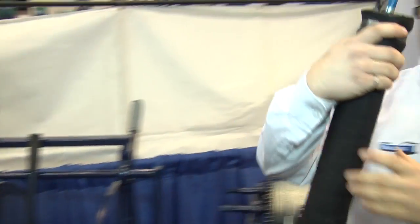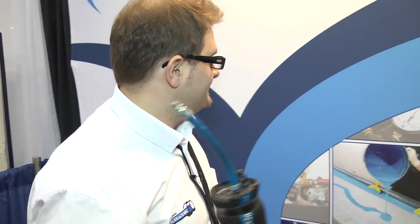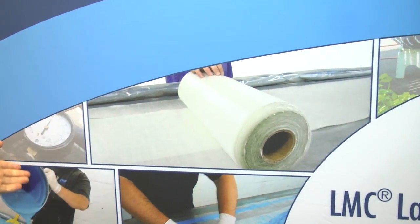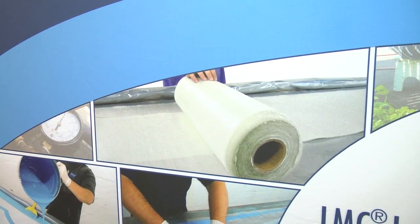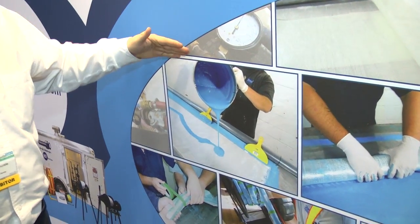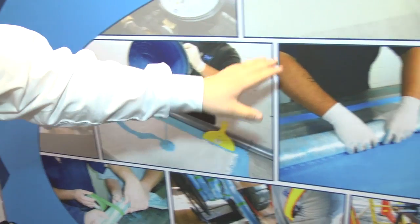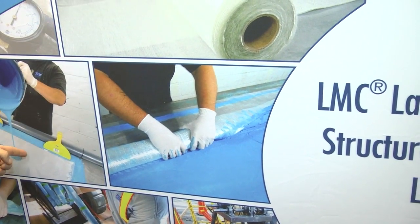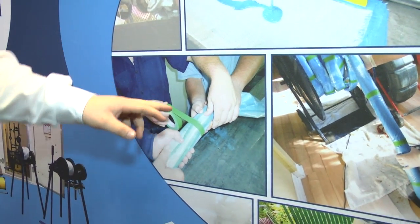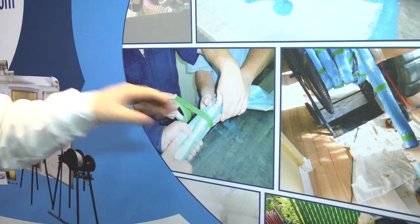We've got the bladder — a rubber bladder like that one. That's a 2.5 inch, used for making 4 to 6 inch repairs — perfect transitions, 4 to 6. You wrap the bladder in polyethylene, right there, and then you spread out your fiberglass, lay it out and cut it at the right length with the measurements taken. Then you wet them out individually with the right amount of resin — that's what the scale is for. You've got the bladder and the fiberglass wetted out, you roll it around the bladder nice and tight, and then fold it to make it smaller. That way you're going to have an easier entry and insertion for an easier installation.